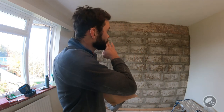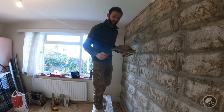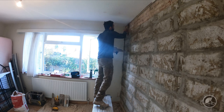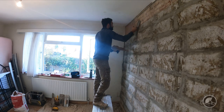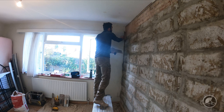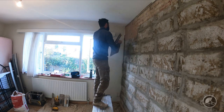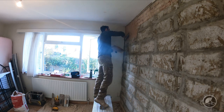What we're going to do on this wall to start with is put a tight coat of hardwall over all the walls, just to really kill that initial suction and give it a base to start working with to get the wall flat. To start applying the hardwall, we're just going to put a nice tight coat over the whole wall, really pushing the hardwall into the brickwork.